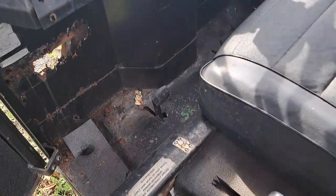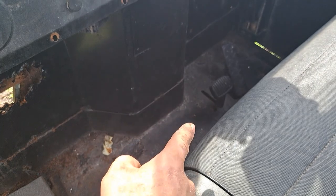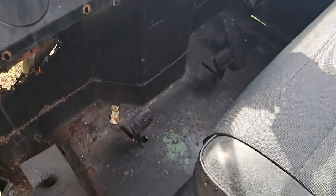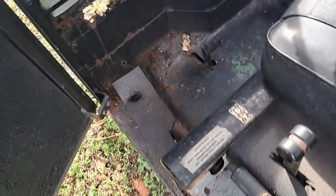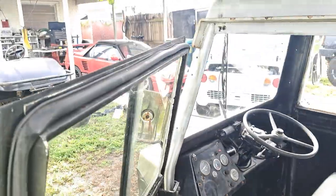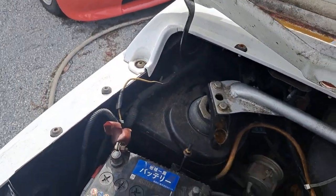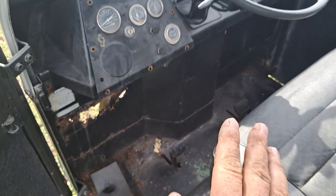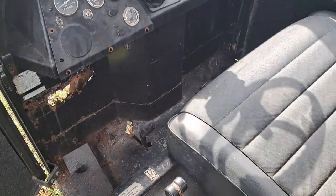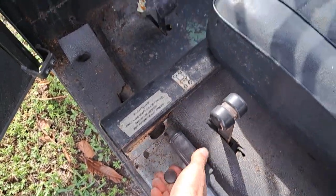This thing is cold-blooded. First, reverse, second, third — it's clutch. Brakes are horrible on this, so put it in neutral like so. Once it shuts off you don't want the battery to drain, so take it off. This thing really doesn't have any brakes — you can step on them and it kind of stops, but it goes slow enough to where you can move it around no problem. To start it, you gotta pull this choke up.